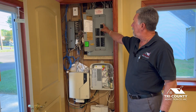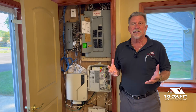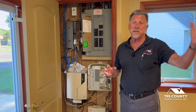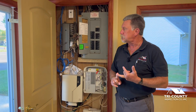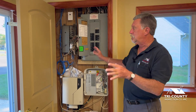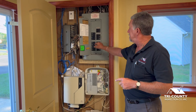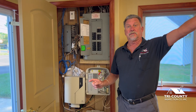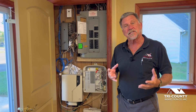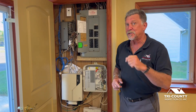In my sub panel, my main disconnect is rated for 100 amps. When I renovated this building, we had to run another line to my office to support general lighting, my mini split, and other electrical needs. So in lieu of filling this panel up — which is almost done anyway — we ran a 60 amp breaker back to my back closet so that we could run individual circuits there as well. One line is easier than six or seven lines.